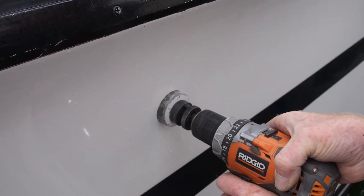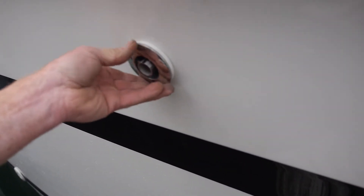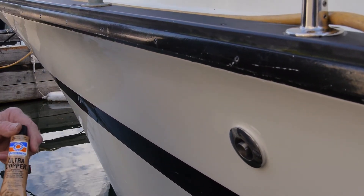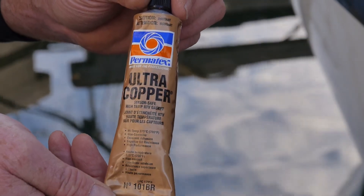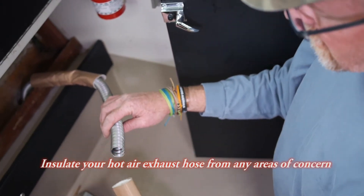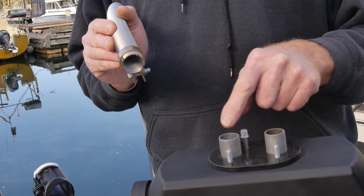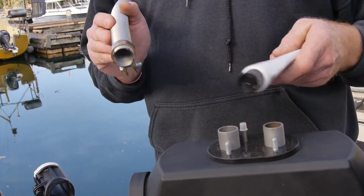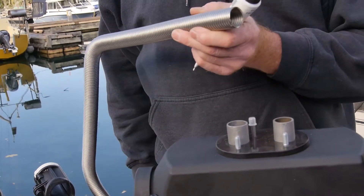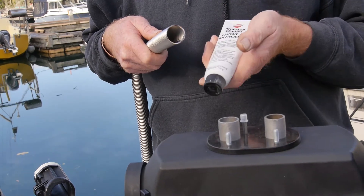Before fastening your heater to your boat, it is best to install your hot air exhaust hose, your air intake hoses, and the ducting to your cabin vents. When installing your through-hull fitting, apply a layer of Permatex sealant to both sides of the gasket for a watertight seal. The hot air exhaust hose can become very hot during operation. Coat your outlet with muffler cement to seal it and ensure a perfect fit — at both the heater outlet and where the through-hull fitting goes. Muffler cement can be picked up at any automotive store.